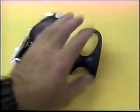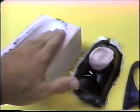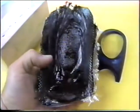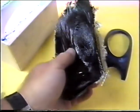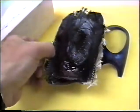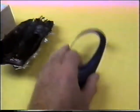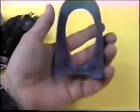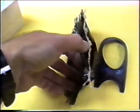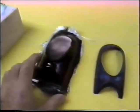Okay, now what I'm going to do is glue this guy down to the 64th plywood, then I'll take the mold and lay up another one. Now you can see how I laid this one up. On the next one, I think I put this on a video already, I want to try a little less carbon in here, and use two layers of a 4 ounce cloth. This is the important idea here. Now that I have one in my hand, I can see the weight of it and everything, and I think I can make this even a little bit lighter by losing one layer of the cloth and some of this carbon. You can't even hit that, so I don't want to overdo the strength part of this.